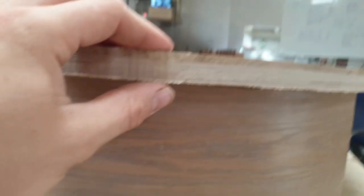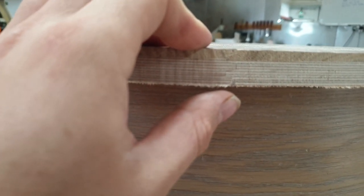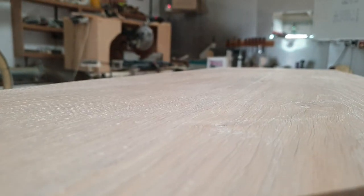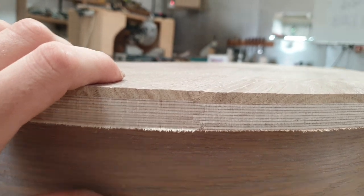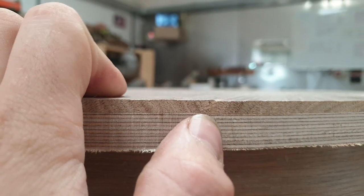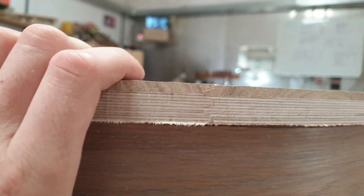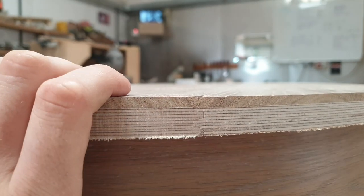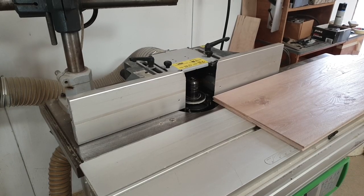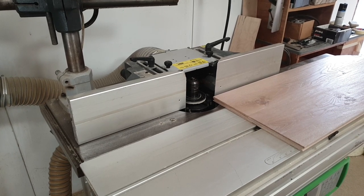While we're here, you can see why I rejointed this piece here. It doesn't look very aligned on the end grain, but it dips up and down along that board, almost a textured surface, with chunks taken out of it all the way through. The reason I planed it is to get that joint nice and strong, nice and tight, so that when I rebate it away it looks like one piece of timber, whereas the two boards just tongue and groove together left a bit of a gap in the end grain on that top section, and you'd have seen the joint. So I've got a 160mm cutter here and a 110mm bearing, so that should give me a 25mm rebate around the curve. That's enough for a start, and then I can take that back a bit more later on.